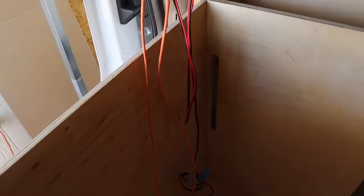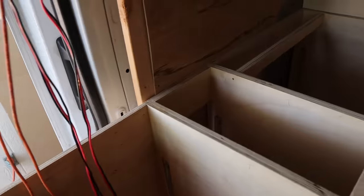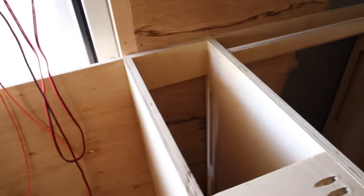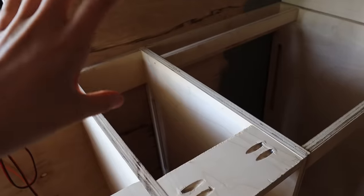What we're going to be doing is venting air through the back of the cabinets. They all have slits routed into them, and then there's going to be a computer fan that's actually pulling air through it so that we actually have airflow. The whole concept of venting your cabinets is kind of overlooked, and I don't see a lot of people talking about it, but it is important. All it takes is creating some kind of way for air to go through your cabinet — you can just cut a slit or some holes in it — and make sure you have something pulling or pushing air out of there.